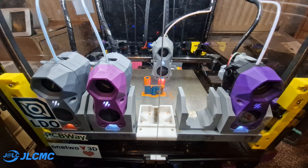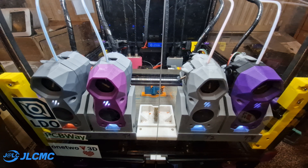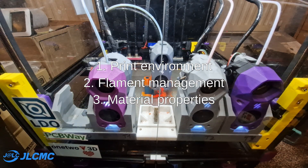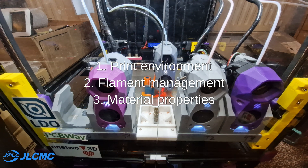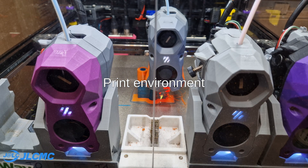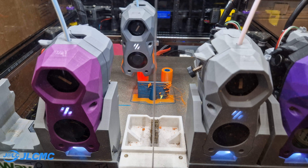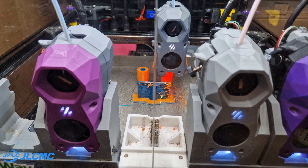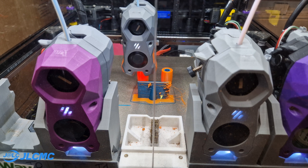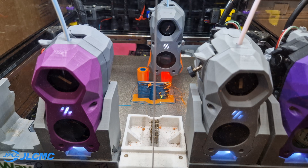The reason why multi-material is so much more difficult can be attributed to three sets of parameters. The first is the compromised print environment, then there is the filament management in each tool head, and lastly there are the general material properties of each material in a print. Starting with the print environment: the two specific parameters shared between all filaments in a print are the bed temperature and the chamber temperature. For multi-color, there's nothing extra to consider — you just set the temperature the same as you would in a traditional single-nozzle print system. For multi-material, however, there will need to be a compromise between the materials.